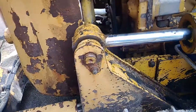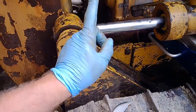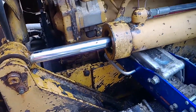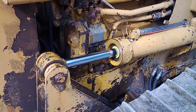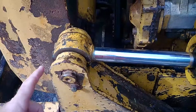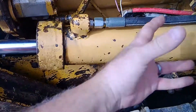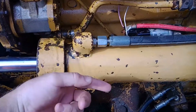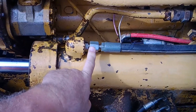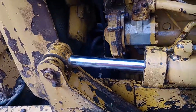I've got everything pretty much together — just got to tighten up that bolt. We'll give it a test run after I top off my hydraulics and see if there are any weeps. Word of advice: when I put this together I loosened the bleeder so it would push back any oil still in the cylinder and release pressure, but I never tightened it back up. So if you see some oil spray, that's why. Make sure you tighten it back up — don't do what I did.